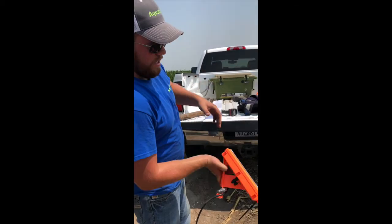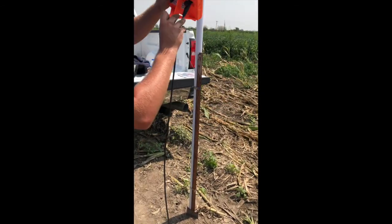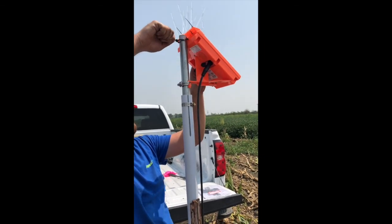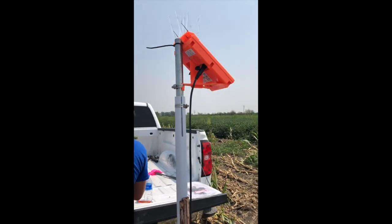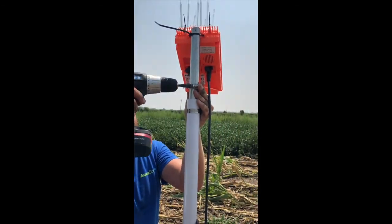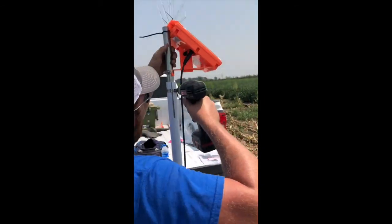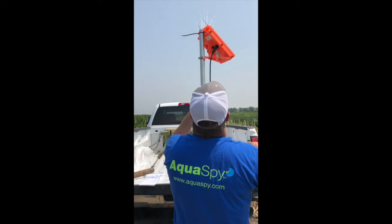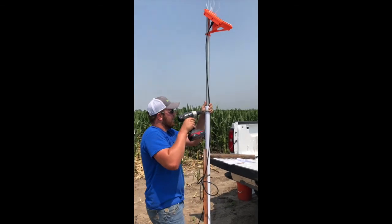Firmware version 16. As you can see, it takes a little while to turn on sometimes. You have another hose clamp on this bracket — you can see how to do that in another video. Run it down the pole with a zip tie on top. Searching for probe... Tighten the zip tie while it's going through its startup phase. Probe detected. I have the comm tower facing south. Loosen it up — depending on the crop, you may or may not have to raise it. In corn you have to raise it. I go up to where I can reach. You don't want to go too high and get it knocked down by the pivot. Tighten that back up.